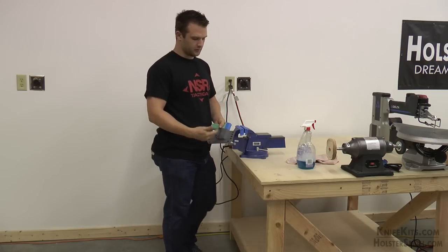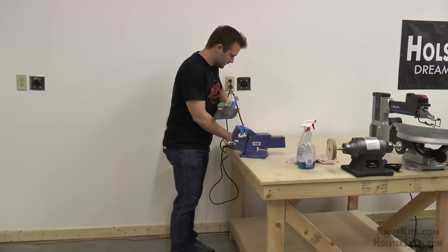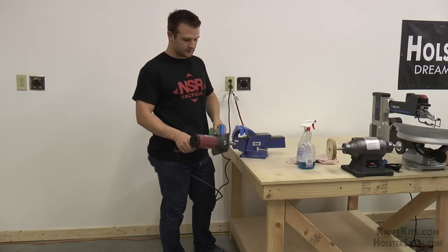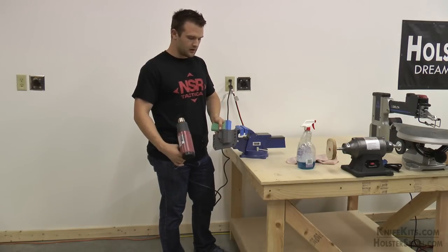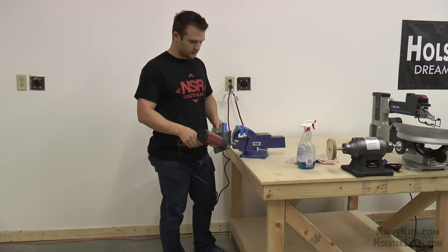Leave the mold gun in there so when we bend it, it doesn't squish down and then become extra tight. So when you're heating, you want to be consistent, back and forth. If you hold it in one spot too long, you could possibly lose definition or burn the KYDEX, depending on your heat gun. So we're just gonna apply heat.